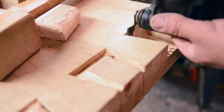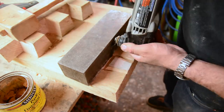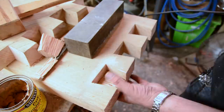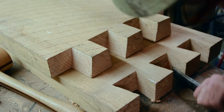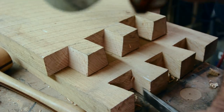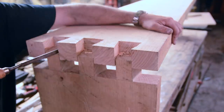I did use the steel block to dig in there to get nice straight cuts. Once I know I'm going in at 90 degrees I'll remove the steel block, and then I start to use the actual cut as my guide. Here I am just cleaning up the cut with an old framing chisel — I got that chisel at a garage sale for five bucks and it's been one of my most useful tools.